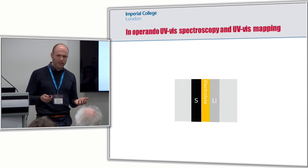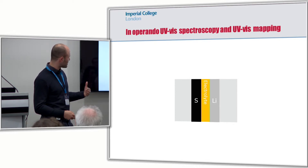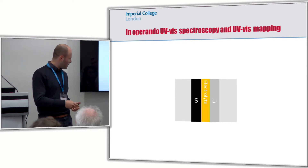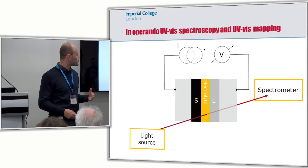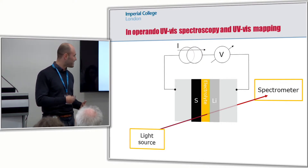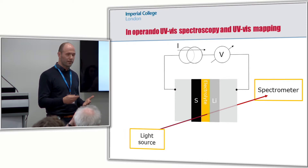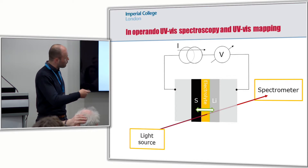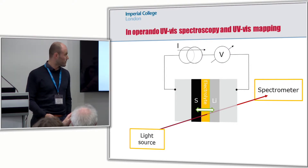What we are thinking is to look at what we call a lateral battery. The device that I'm going to present is basically composed of lithium and sulfur electrodes that sit next to each other, and there's a gap in between where we can, while we measure electrically, access the optical properties of it. This reminds me of what Elizabeth Miller presented yesterday — it's called a cross-sectional battery — and the idea is that if we can do this, then we can really have a transmission mode optical spectroscopy characterization technique, and if we focus our beam, it is also possible to do some mapping, which we've seen from the previous speaker is actually quite a useful thing to do.